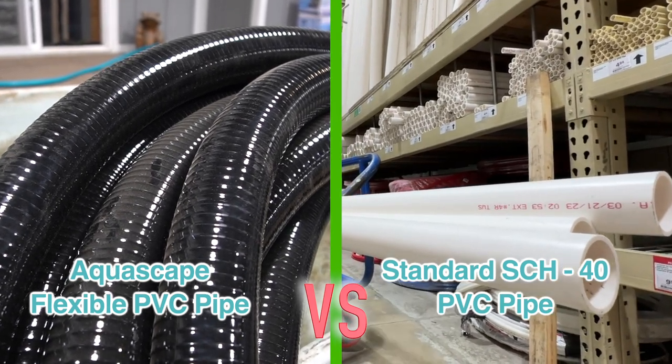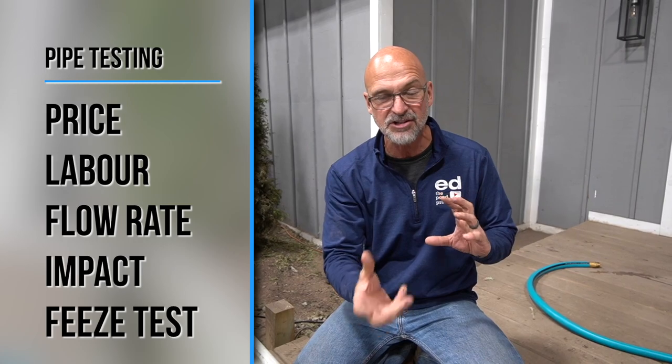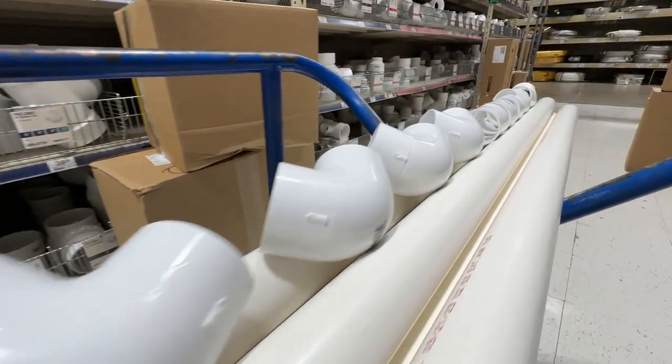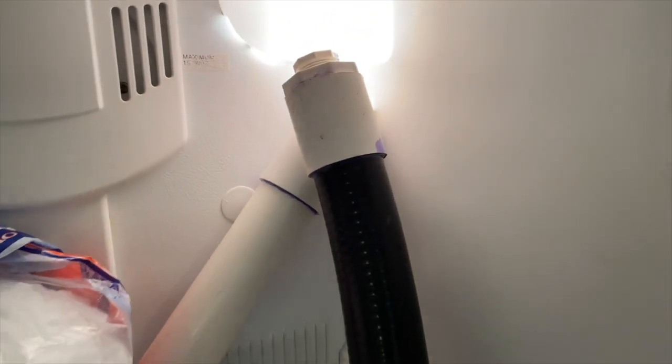What type of pipe are we going to use? The efficiency of the installation on the job site — from hooking up the pump, going all the way over to the biofilter — how many elbows, how many joints, how many connections, how much pipe am I going to use? Also the back pressure: the TDH is created by all those 90-degree elbows. When water velocity is flying down pipe systems, every time water hits a 90-degree elbow it slows down, picks up speed again, hits another 90-degree elbow, slows down again. It's a constant battle and all that puts pressure on your pump system. We want to create an efficient system that goes in smoothly, can resist freeze-thaw, and is very cost-effective to work with.